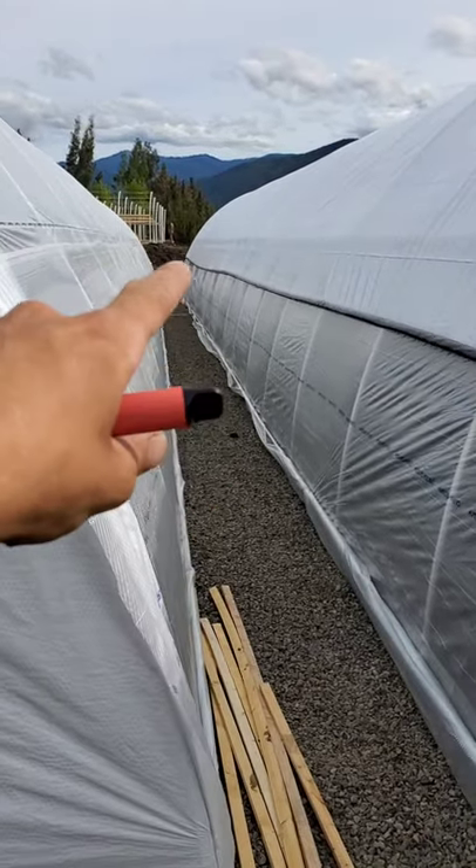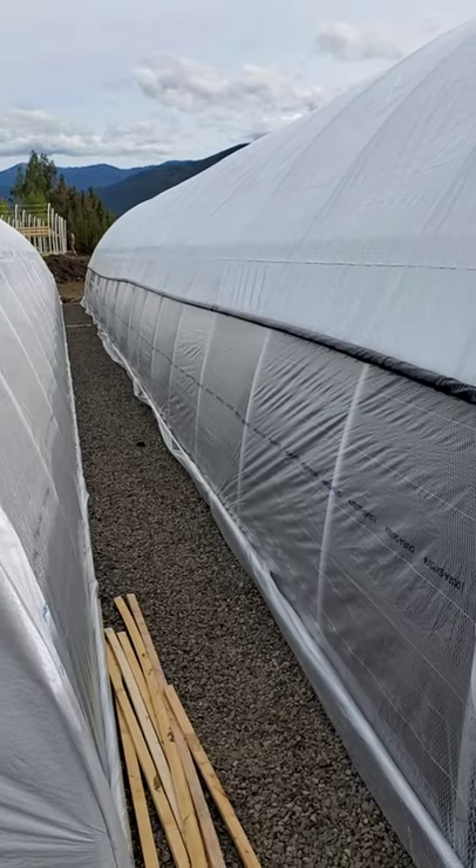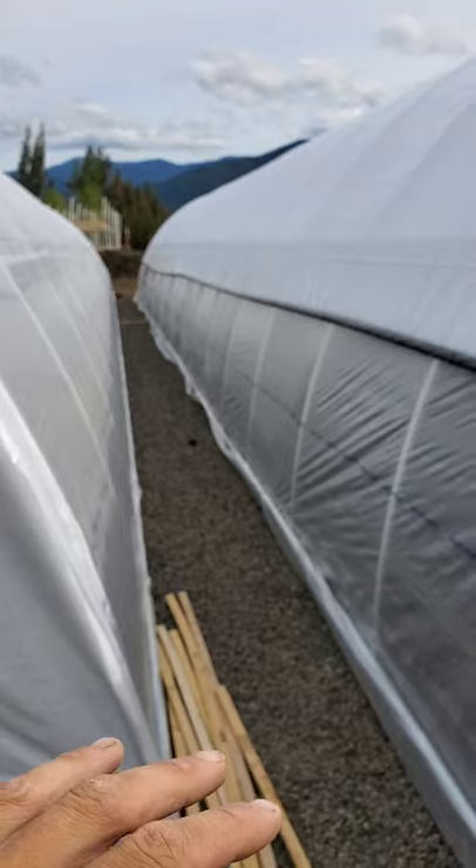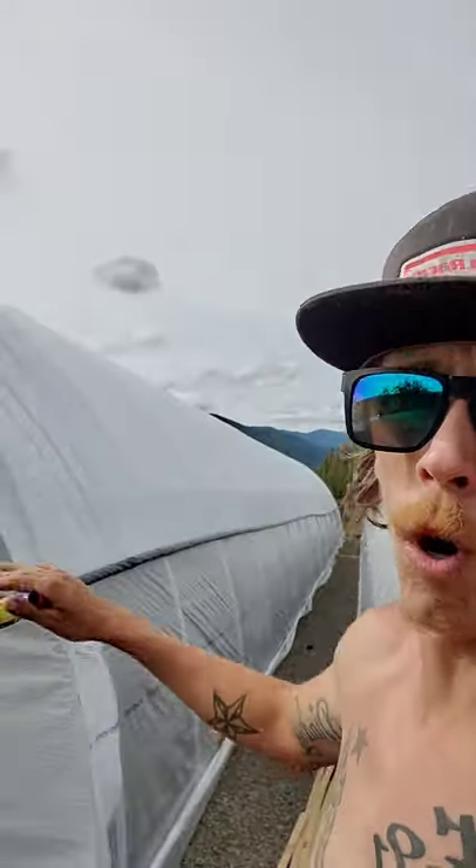You can see I have a little dip right here, but when it gets up to the top for whatever reason it straightens out. So don't obsess on what it looks like when the blackout's rolling up. You want to know that it sits flat and perfect on the bottom, and you want it to sit perfect on the top. It doesn't matter what it looks like in between as long as it's not too aggressive. If it's all wonky, of course change it, but let the blackout roll and let it go to the top of the greenhouse — see where it's going to stop and what it's going to look like.